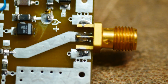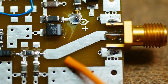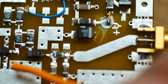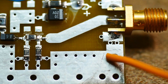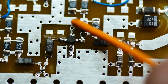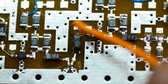It's a lumped-element design, though they were careful with a little stripline or microstrip on the signal path. This trace width is about right for 50 ohms on a 62-mil board, so they definitely paid attention to impedance there. The rest is all lumped element with no further impedance concerns. On the back there's a ground plane with lots of stitched vias to ensure a good microwave/RF ground. There's also a ground moat around traces to isolate the signal path so signals wouldn't leak off.